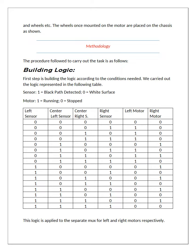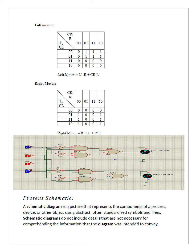The first step of the methodology that we followed is building the logic. We first formulated the truth table that we needed to follow. Using K-maps, we formulated the basic equations for the left motor and the right motor. Beneath them is the diagram of the basic circuit for the left and right motors using basic logic gates.